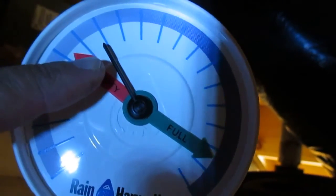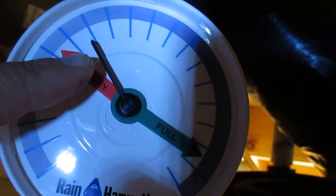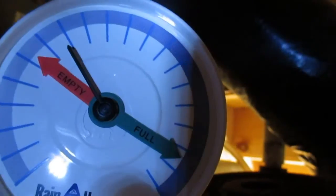Here's the breakers to power the pump in the well. I'll turn those on. That tank should start filling with water. We can see our level indicator going up here slowly as the pump is starting to fill the tank. Here's the water level in the tank here, which is roughly a third full. Our indicator at the top, there it says 45 gallons, but when it cycles through 34%. So that's showing about a third, so that looks good. I have the receiver in another room, and it's also reading 34%.